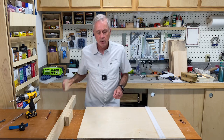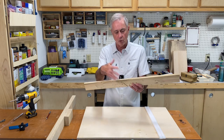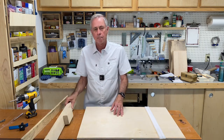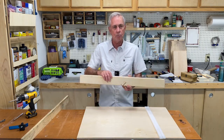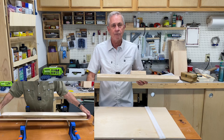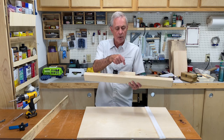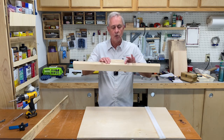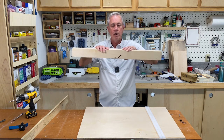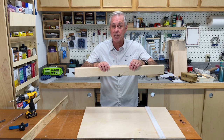You'll also need a front portion for your sled. I used some scrap poplar I had laying around — it's got worm holes and everything, but it doesn't matter. It's really just there to stabilize the front of the sled. For the back push portion, I used three pieces of half-inch plywood laminated together. I made it longer than needed so when I cut off an end I could glue it back here to the back of the sled — the blade goes through there. As long as I keep my hands outside that box I'm not going to cut any fingers or thumbs.